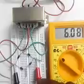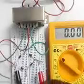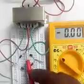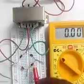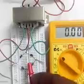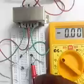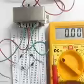Alternating current is being converted into direct current, but only half of the cycle is being rectified, that's why we are getting only half of the voltage. Though the voltage at this terminal is 13 volt AC, this part of the bridge is conducting only for the positive half cycle. The negative half cycle is being neglected because the diode will not allow conduction in the reverse direction, so this will rectify only the positive half cycle.